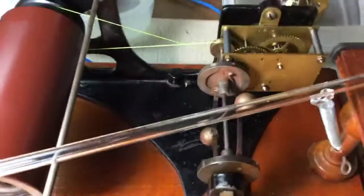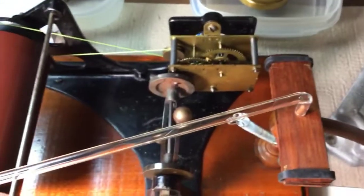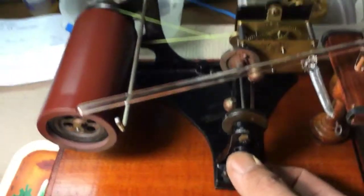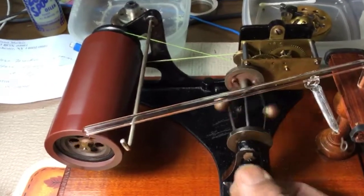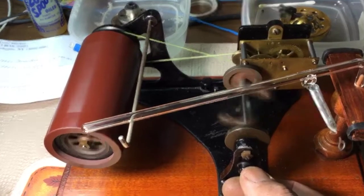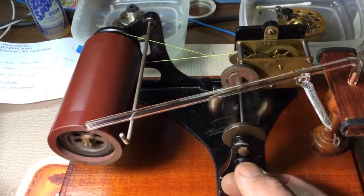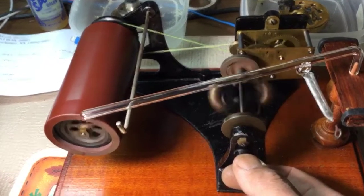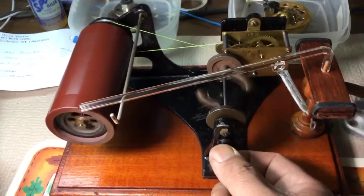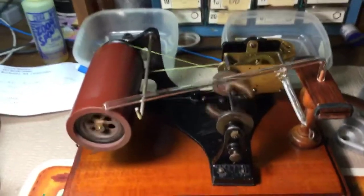In the side, we can insert a small horn, or in this case, I'm using listening tubes. Looking at the top here, it has a two-spring governor with a clockwork motor, and we turn it on by turning up the governor speed. It's similar to what you'd see on a puck phonograph. This had a piece of thread on it, and I switched the thread out for a piece of Dacron, which is more grippy, and I got it up to speed.